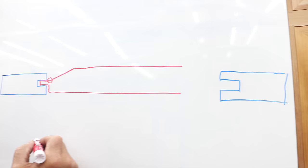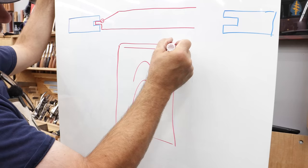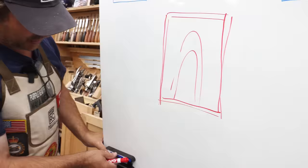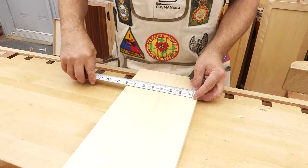We're going to work with a piece of wood where the grain runs in this direction. I suggest making all the end-grain cuts first — that'll result in some tearout, but you can clean it up when you process that edge. Leave the long edges last, because the torn grain from the end cuts will get taken care of as you do those. We're going to start with three-quarter pine — this piece is seven and five-eighths inches wide by fifteen and seven-eighths inches long.